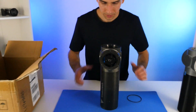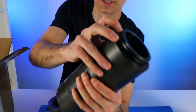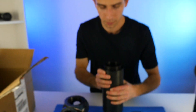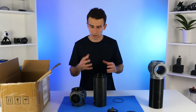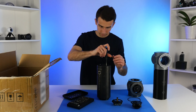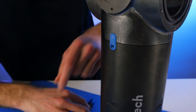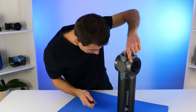That is perfect. We've got two different types of seals here. We've got these two radial seals, and those are the ones that will be preventing water ingress at low pressures. And then we've got this face seal that runs around the face and seals these two parts together — that's going to be our higher pressure seal. At higher pressures, as the drop cam descends, the two parts will get pushed together very, very hard, and that should technically make that O-ring even stronger.